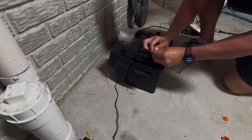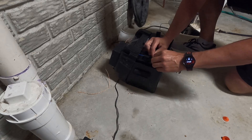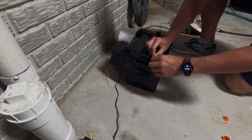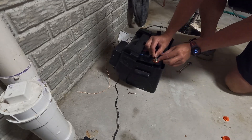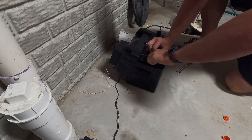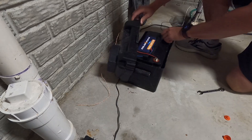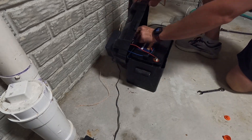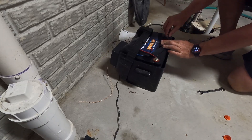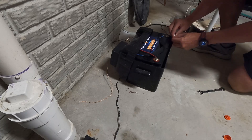I'm going to have to make a couple of modifications. First, I have this little probe that checks for water in the battery — I'm going to connect that up to the positive side so the no-water alarm won't go off. Other than that, I'm going to use a lithium iron phosphate charger because I don't want to use the lead acid charger inside the Watchdog unit — and I don't want to use the lead acid charger on an AGM battery either. So that made up my mind: if I'm not buying a whole new set just to get an AGM battery, I'm going this route with the lithium iron phosphate, which has a warranty and should last me 10 years.